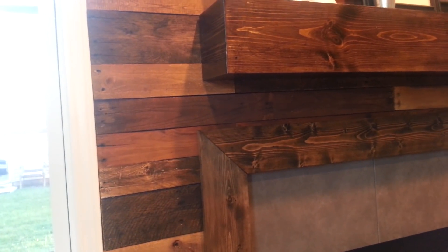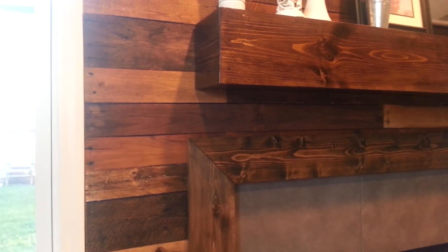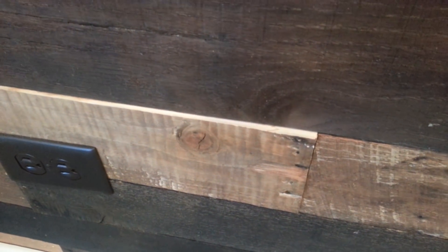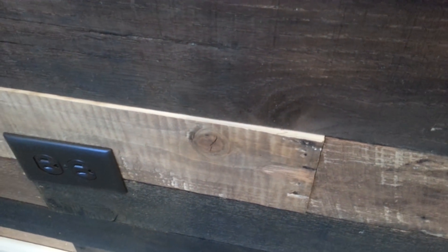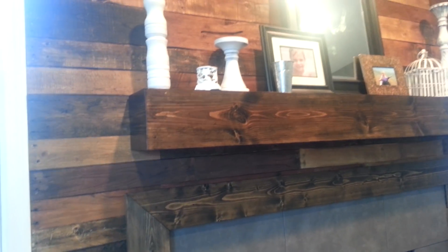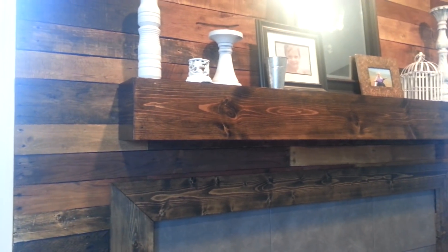My example is going to show you why you had to do the end pieces — I think it's covered up by the mantle now. Like this — I'm going to have to touch this up. Because everything is not going to be perfect; some of them are going to bow out a little bit. That's why you want to make sure you get both sides and both ends stained, so when you put it up you're good to go.